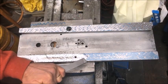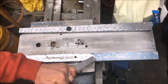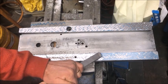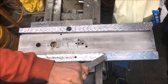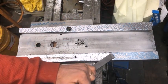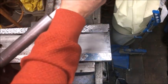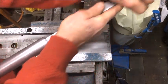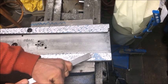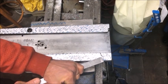Carrying on showing a little bit more of the hand scraping — it's a little bit more inconsistent than machine scraping and a lot harder; I can really build up a sweat this way. Although it is harder and less consistent, practice makes perfect, and this is also good enough for any practical use. I like the pad against the stomach, holding with both hands to control the scraping and avoid scratching the part — and I think this technique is less tiresome.